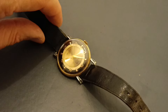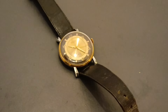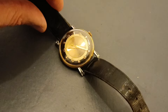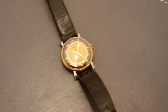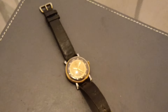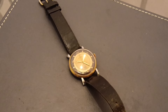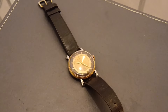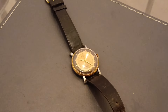You could also take the back off which would be even quicker to let moisture escape. As long as the crystal is face-up with heat, the moisture rises and goes onto the crystal, but reversing it with heat should steam it out. That's a nice little watch - I will be giving it a clean-up, and there'll probably be a separate video and an update to see if it's still going. I'm now going to try this trick on a couple of other watches I couldn't get working - I tried WD-40 doing the same thing but it didn't work, so lighter fluid might work where that didn't. Thanks for watching - take care, bye bye.